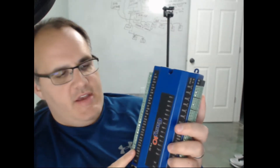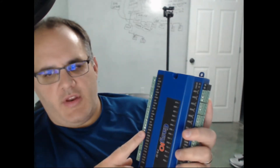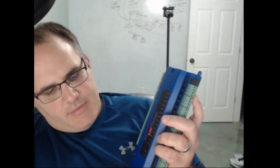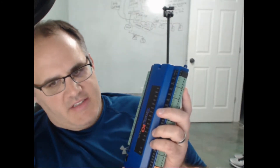Next up, and this is the one I'm really excited about — this is the FS32, so 32 inputs and outputs. These controllers have the programming software built into them, which is kind of cool. There are universal inputs, but there's no DC power — no 15 volts DC — so if you had to do 4-20 milliamp or anything like that, you'd have to externally source it. It also has an 'S' on the trunk and I'm not sure if that means shield or reference.